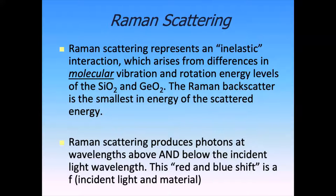The photon is absorbed and then popped back out at the same wavelength and frequency — same color as the light coming in. Raman backscatter produces inelastic scattering. The photon is absorbed by the molecule in the glass and then re-emitted, but instead of being re-emitted at the same wavelength, it is re-emitted at one of two different wavelengths: either a longer wavelength — we call that Stokes scattering or a red shift — or returned at a higher frequency, a shorter wavelength, a blue shift. Those are the anti-Stokes photons.